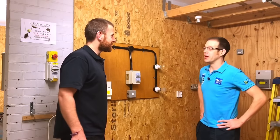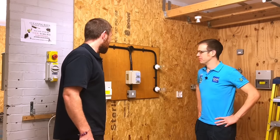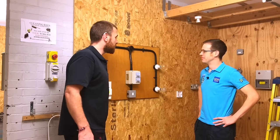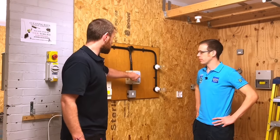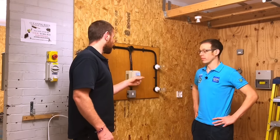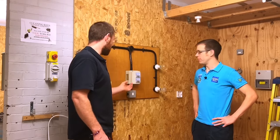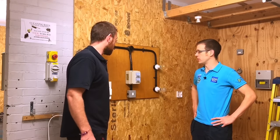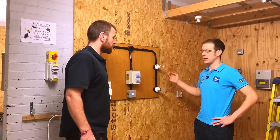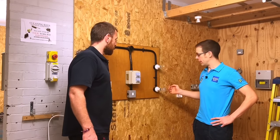Let's summarize the video. It's been a really good demonstration of how the contactor works. I particularly like the ammeter setup because in the previous theory video we couldn't actually show how much current was being drawn through the coil. We're also going to use this rig in a future video to show the difference between the current drawn by LED lighting and traditional filament lighting - so that'll be interesting.